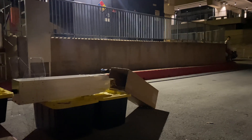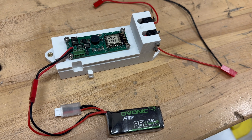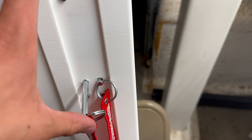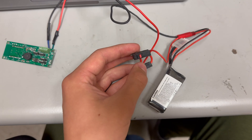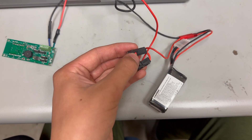I did my first practice integration and then tried deployment. Shout out to Matthew for making me these deployment charges. For avionics, I used an off-the-shelf rocket flight computer. I decided to make the arming fancy and put two remove-before-flight tags that would arm when they were removed. If vibrations or debris caused one of the switches to trip, the second one would keep it armed and ensure that the battery wouldn't cut out.